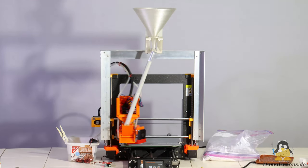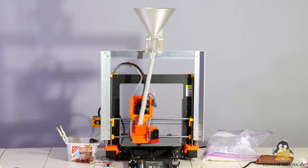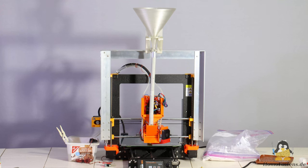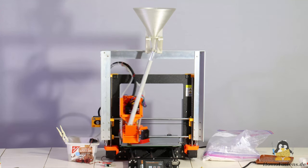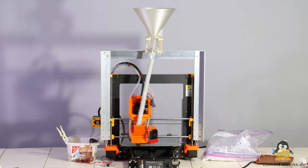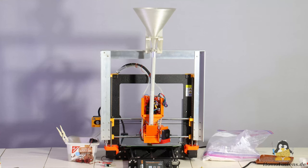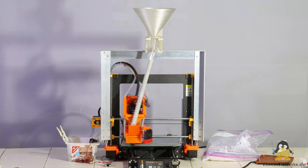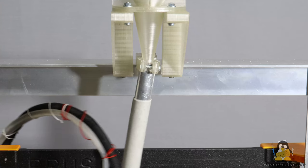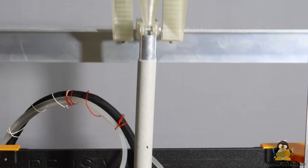There are various solutions for attaching the external powder reservoir, all with specific advantages and disadvantages. I chose to attach this to the Z axis. A frame made of three aluminum angle profiles holds the storage container at the top. The powder is fed via two tubes that fit one into another — one made of plastic and one made of aluminum — enabling length compensation when moving along the X axis. Since the storage container is attached to the Z axis, there is no need for length compensation in that direction. Not all printed parts are used and some have been modified; for example, the smaller cone has been omitted.